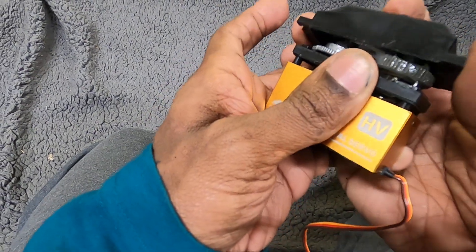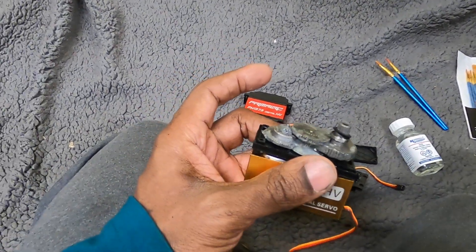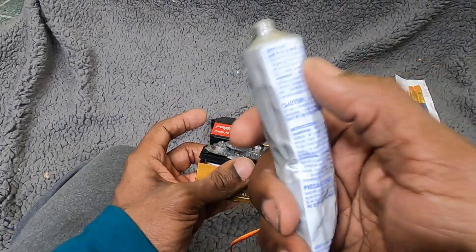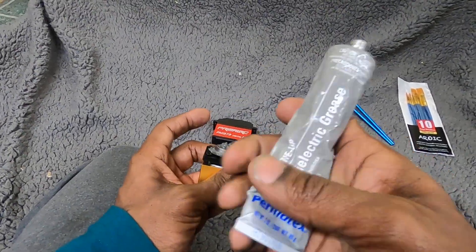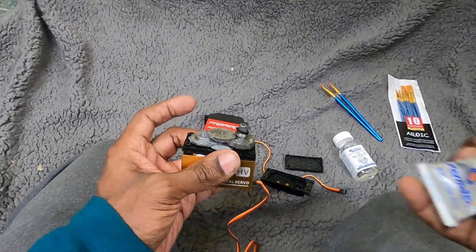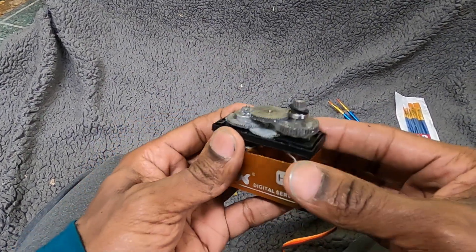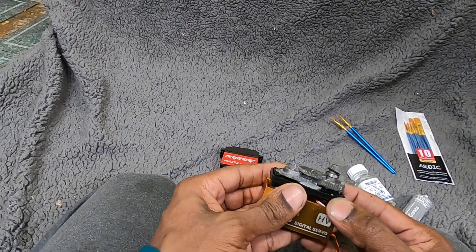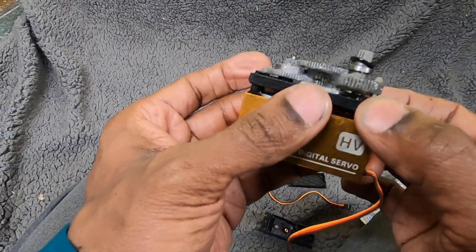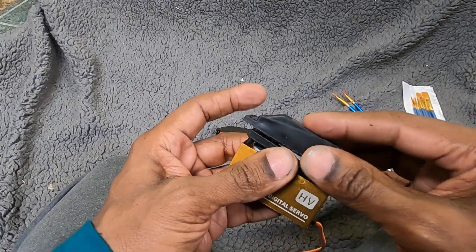Standing water, even with the coating on it, can short this stuff out. So what I do is crack the servo open. This one I've already been on, and it does not come with all that nice lube on there. I like to put dielectric grease on it since it really sticks to the gears, and since it's dielectric there are no contaminants whatsoever in this grease that might corrode anything. A lot of other greases — who knows what's in them — but this stuff will not have contaminants, period. I don't need my gears getting corroded because I put some lube on there that has trace metals or other nonsense that would destroy the gears.